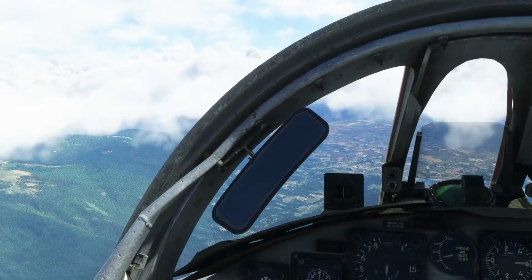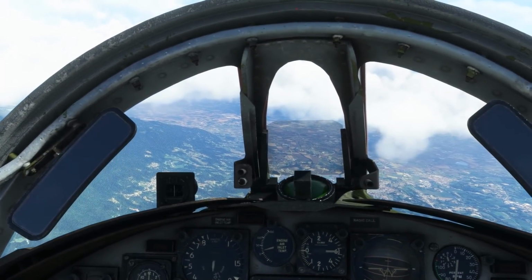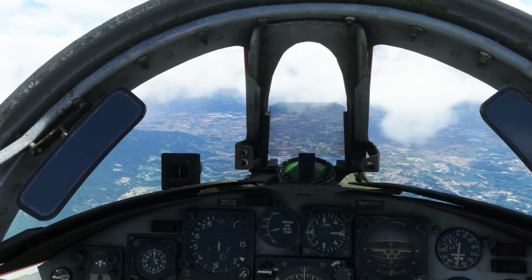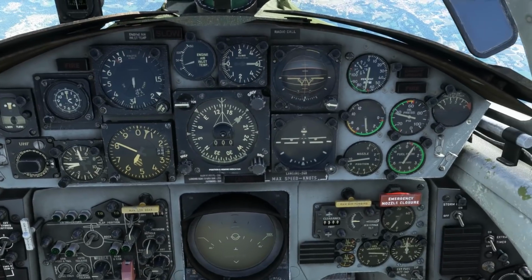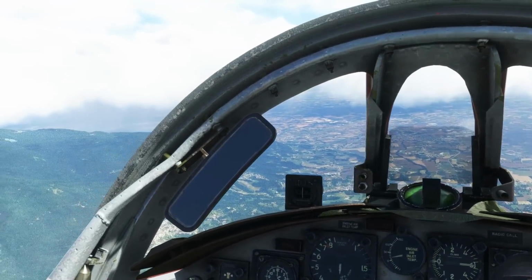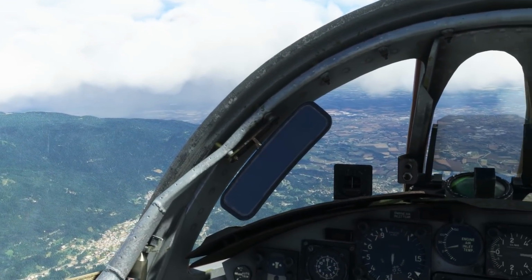So as I say, just following the contours of these hills for now, just coming back below the cloud layer. And then we'll track back out towards the east, back towards Aviano. Running through our descent checks, the engine anti-ice we can leave off, altimeter is set, fuel quantity. Still got plenty of fuel on board the aircraft, we're down to about 700 pounds there in each tip tank, and we've got full fuel load there on the aircraft tanks. Oxygen is set as required.